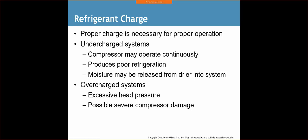It's a little bit more off topic, but I'm just going to show you the right way of actually doing this. I'm just going to open up a project that I've done for some people, and here's a good one. The thing that comes about with doing a Manual J is it's going to tell you what the heat load of the building is. That's going to be our primary concern, and we want to be able to remove that heat load.